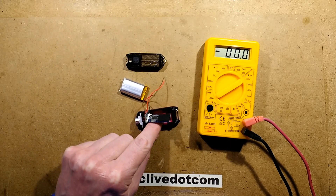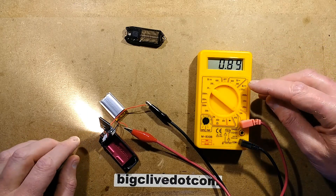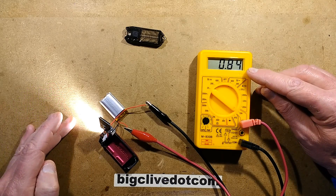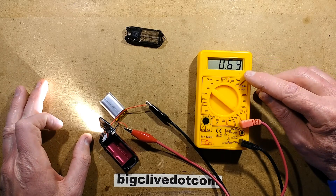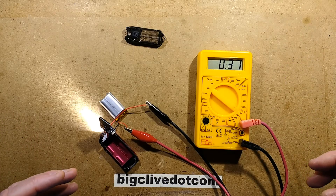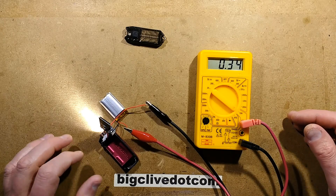The TIP is still very impressive for certain applications. I've now sussed out how it does thermal management: if you put it on the 3-watt setting — typically around 900mA to 1A or more — it holds that for about 25 seconds, then very subtly starts creeping the current back down. It's so imperceptible you don't even realize it's happening. It winds itself back down to about the 300mA setting — roughly 1 watt — which is its normal high. If you need a burst of extra light you can press the button to go back up to full power, but after that time delay it will nudge itself back to the more sensible level, avoiding the risk of overheating.